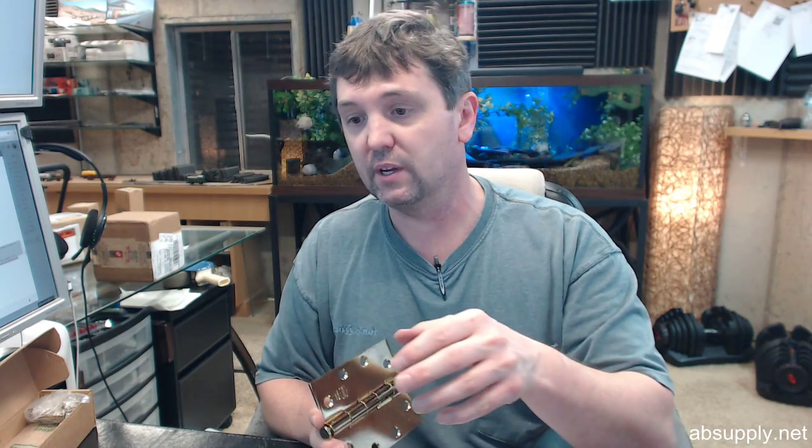In the lower left-hand corner, you'll see catalog number and 3 columns. You'll see how the 4th digit changes when the base material changes. So the last 0 in 5000 means steel-based, it's made of steel. If it turns to 1, it's brass or bronze. If it's 2, then it's stainless steel. So you can immediately figure out that if you want a full mortise plain bearing hinge made of stainless, it'd be a 5002. It's that simple.